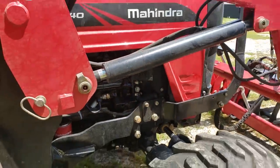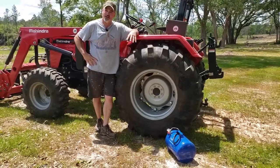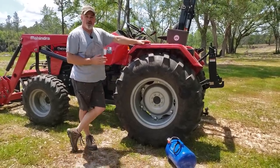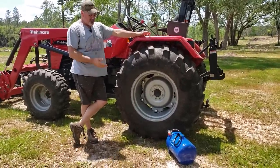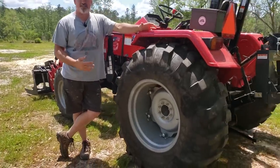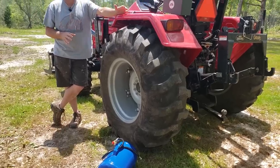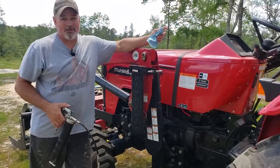Step three: simply check your tire pressure. All four of my tires are loaded with ballast — I put water in them. Here in Florida we don't have to worry about freezing. I'll add a card for you to check out that process of adding ballast to your tires. Since I've got ballast in all four tires, I do a visual inspection — make sure the tread wear is even, look at the sidewalls, and if need be I'll add air. If you see any sagging or droop, or uneven tread wear, position your valve stems at 12 o'clock and fill up. If you don't have ballast, check your air pressure and fill to the owner's manual specifications.